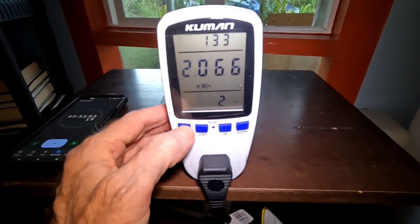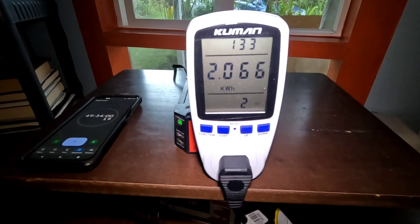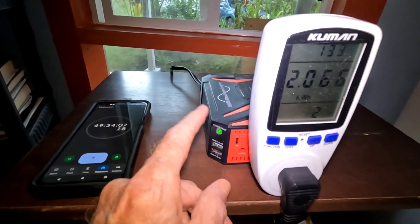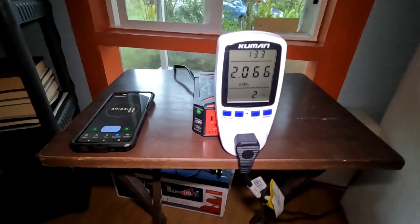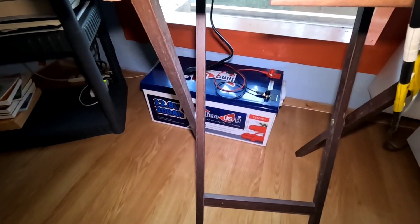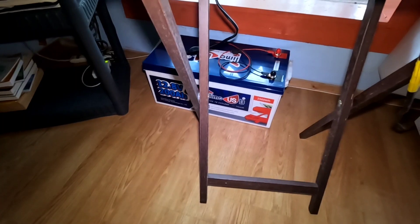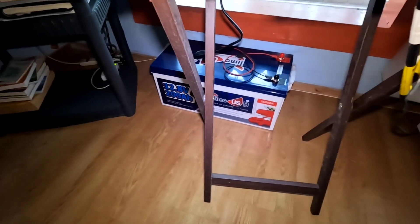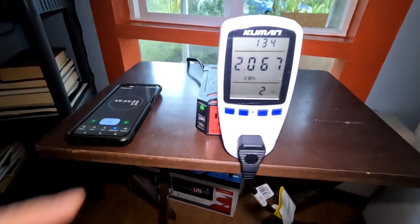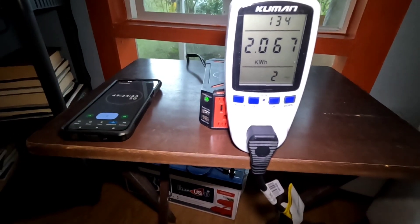At 49 hours of drawdown, this battery has registered 2.066 kilowatt-hours. It's not going to be an accurate read without the shunt, but there is a comparison to be made. That battery has a rated value of 2,944 watt-hours. The OgreeFee, for comparison, had a rated 2,560 watt-hours and what I registered on it was 1,978 watt-hours — so the OgreeFee was likely working well.